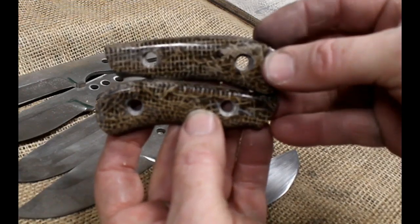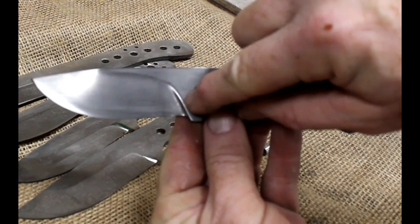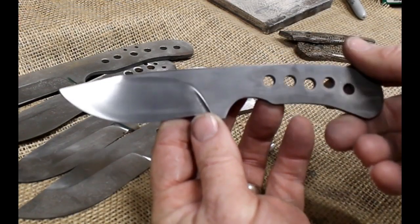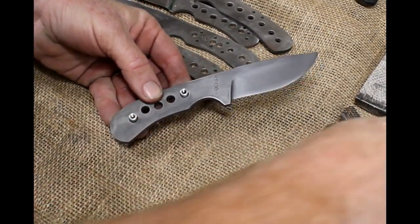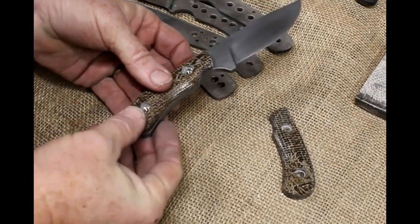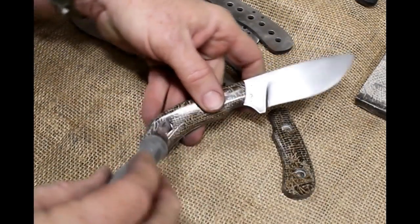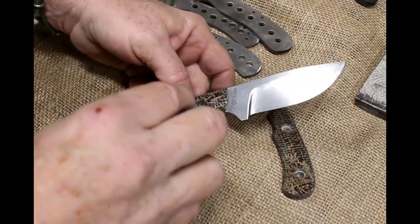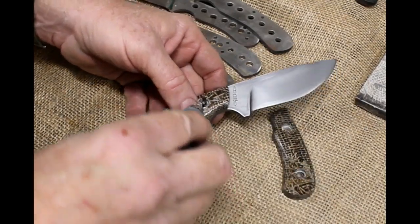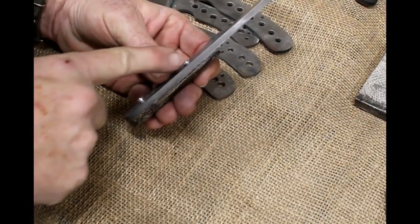So I redid the entire handle-making project and eliminated dyeing the burlap different colors. While I had the knife apart, I did regrind the bevels back a little and reprofile the blade to my liking. I'm not going to duplicate the whole micarta process again because it's the exact same — the only difference was I did not stain the burlap. I just used all natural tan-colored burlap, and the only variation was using small pieces laid on top of larger pieces to get a variety of different shapes in the finished product and still see some of the fibers and texture inside.